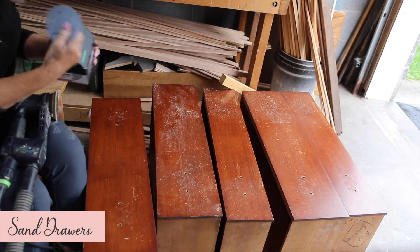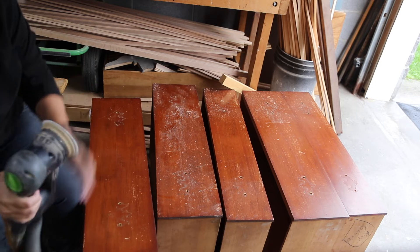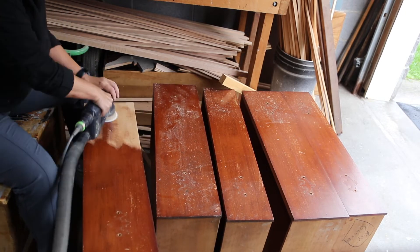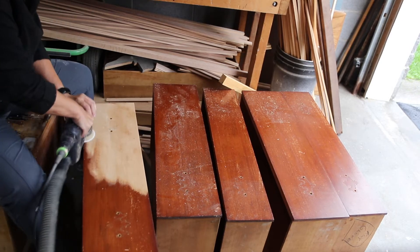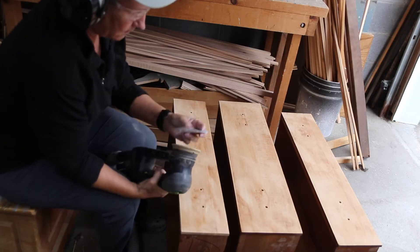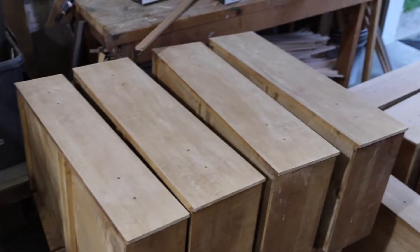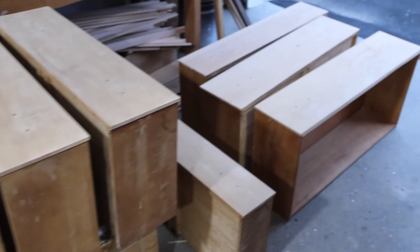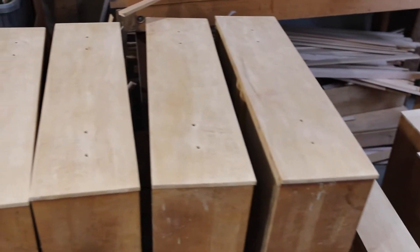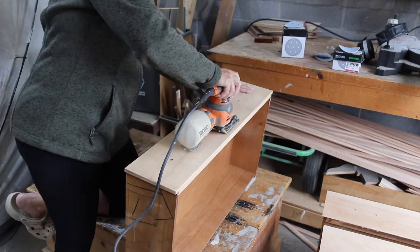Now that the frame is complete, it's time to move over to the drawers — and there's more sanding to be done. Since the drawers are going to be stained, they need to be sanded down to bare wood. We used our Festool Rotex with 80 grit sandpaper for the first run. It's an amazing sander that removes any top surface including paints, stains, and polyurethanes quickly with little effort. Once the initial sand was complete we switched to 120 grit sandpaper for another pass to get rid of some leftover blotchiness. The stain drawers are the main feature of this project, so it's extremely important to ensure the surface was well prepped and smooth. Everyone always says when you think you're done sanding, sand some more — so we took out our rigid sander and did another pass with 220 grit sandpaper.